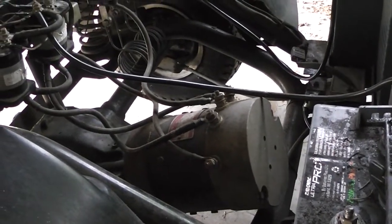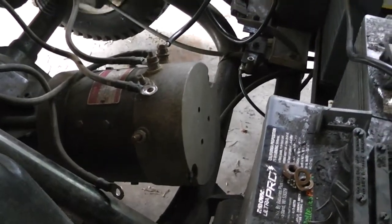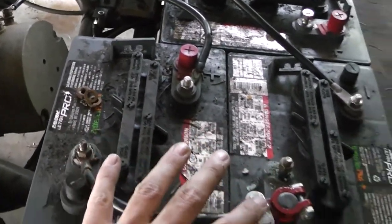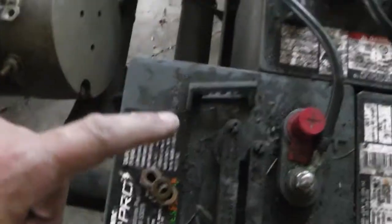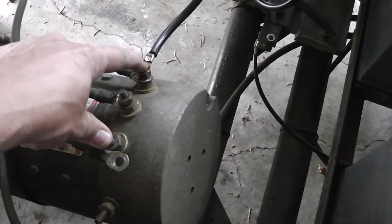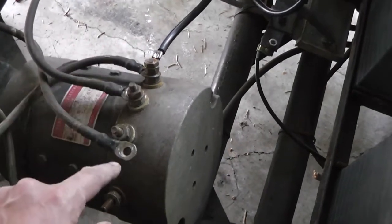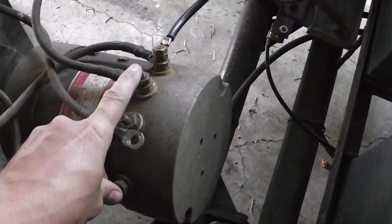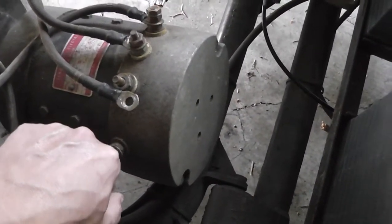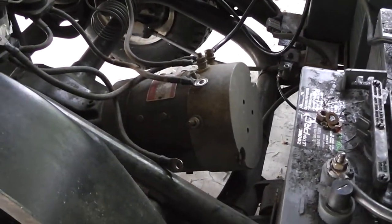Okay, so something's not right. Since I'm having difficulty using the solenoids, ruling out motor problems, I am going to disconnect these two batteries, leaving a 12-volt system here to run the motor. So I've already run this positive wire over where it needs to go. If I touch a positive to here, we should have reverse. If I touch a positive here, with the negative clamped here, off of the 12-volt pack, we should have forward with very little sparkage, and it should just start moving. That's my theory. I'm going to put the tripod out, and we're going to watch me do it live.